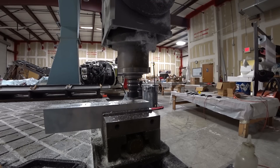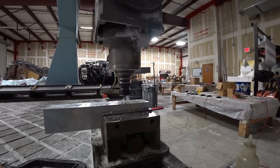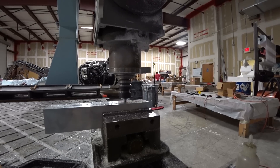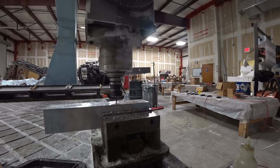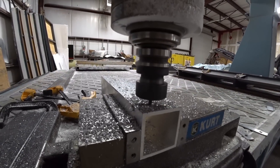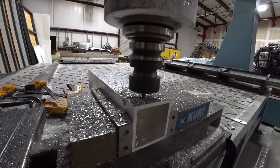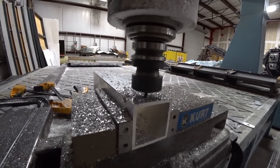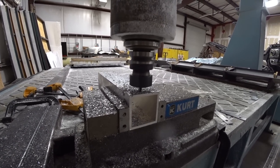Here I'm using the CNC to cut out the brackets from a piece of square aluminum tubing. The brackets are basically like little C-channels — there'll be four C-channels for each of the rudder pedals, and then some upper ones for the brakes as well. This is what it looks like cutting out the first side. You've seen me use a similar technique when I was creating some of the stuff for the rudder pedals assembly themselves.